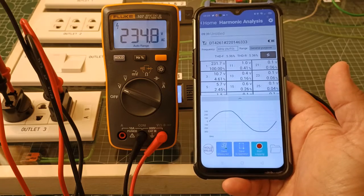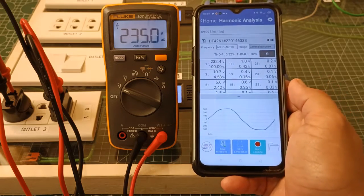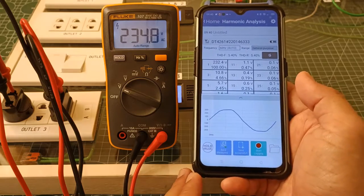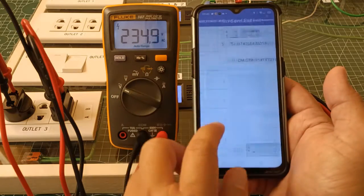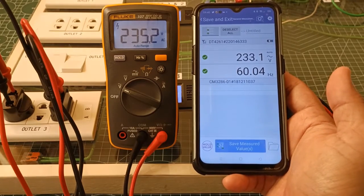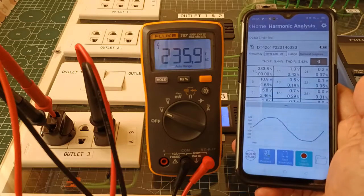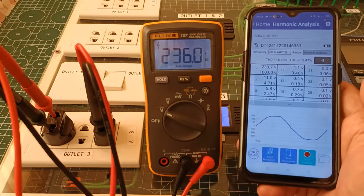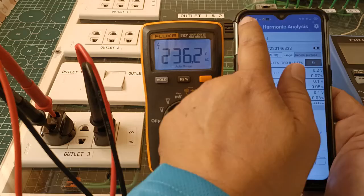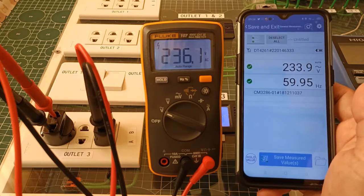For an averaging digital multimeter, it will produce true RMS values provided that the AC voltage waveform is a pure sine wave with very little to no distortion. But depending on the amount of voltage distortion or the shape of the AC wave, the readings of an averaging multimeter can be higher or lower. This difference in reading is not a defect of the Fluke 107 — it is simply a logical result of the averaging method it uses to calculate AC voltage. If you need true RMS accuracy at all times, you would need a true RMS digital multimeter or clamp meter. But if that is not a priority, the precision of the Fluke 107 in its averaging method is more than enough for detecting nominal AC voltage values.